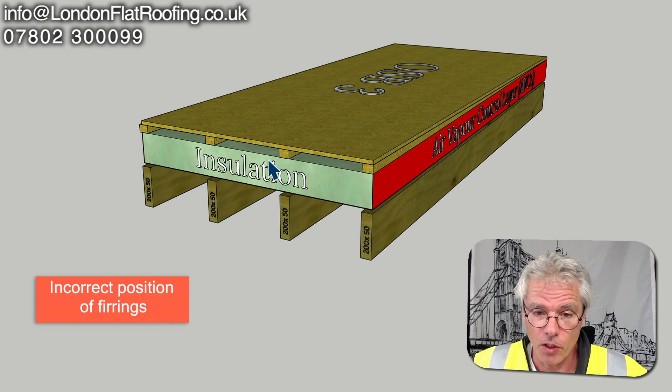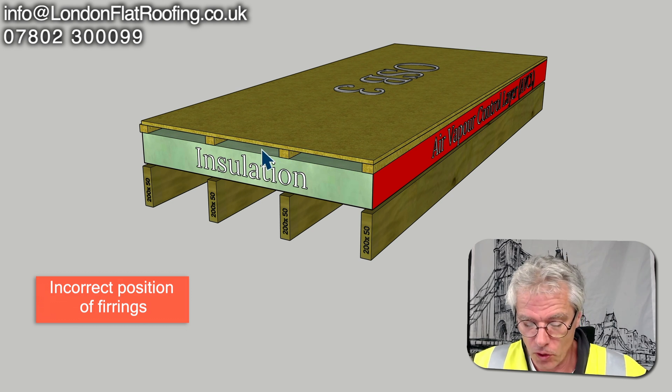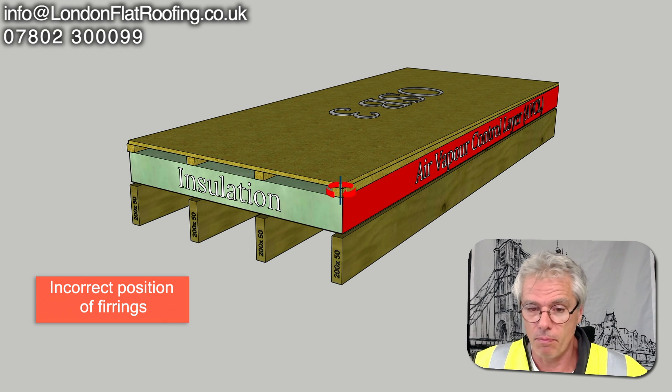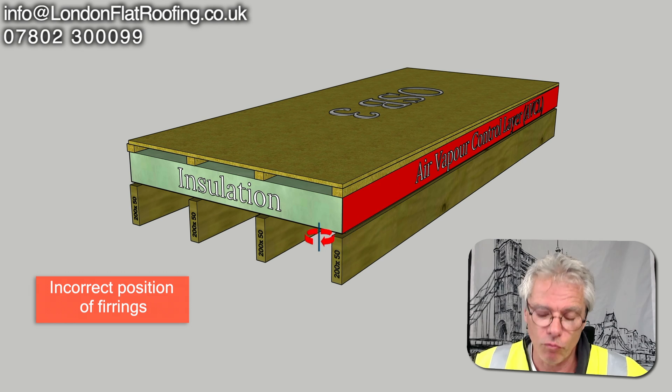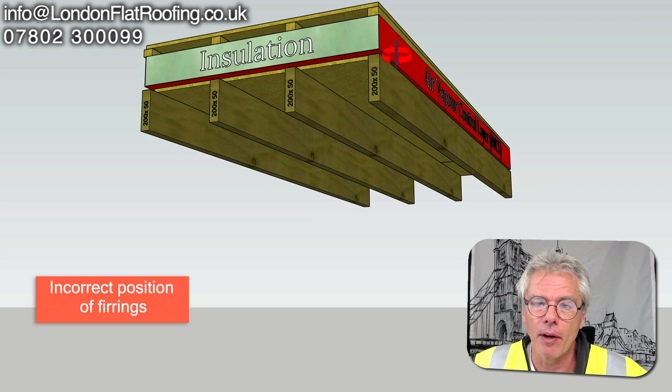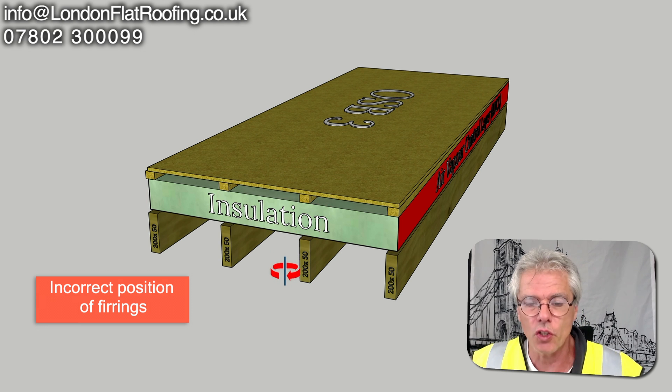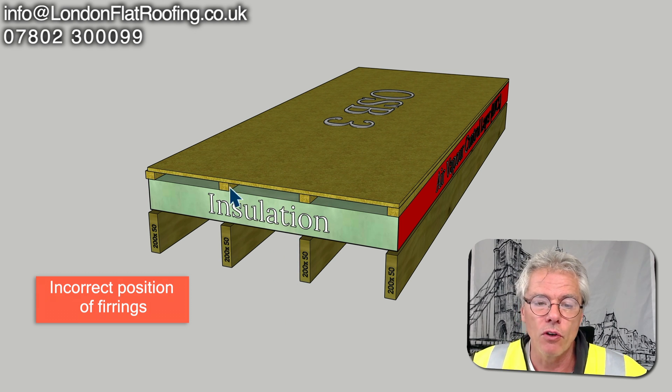The answer is: you can do what you want, but it's not a good idea. The reason it's not a good idea is because you end up with this gap — which I'm showing you here — that has no ventilation to it whatsoever. This diagram shows a warm roof construction with a vapour barrier running all the way around the insulation. Theoretically no moisture should come up through into that void, but it's a vapour barrier, not a vapour stop. There will be some movement of moisture that migrates through, and if it gets trapped in there — we'd call it interstitial condensation — that could rot the back of the boards.